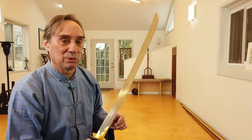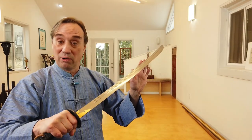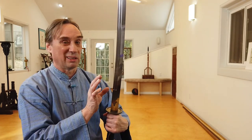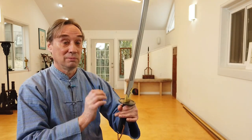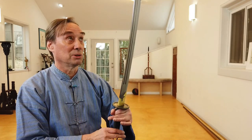So there you have it: three yan mao dao, or yan ling dao — you see yan mao dao more in manuals, but yan ling dao is also a proper name for these — all from the Art of Fire and Iron. Decent forge, good quality blade. Let's see the temper here. This one is a little bit tighter, but I think that's just the edge geometry of the sword, not the heat treating — could just be a little bit thicker, a little different fuller. When I hit it I can feel a vibration in my hand like a tuning fork, which is nice. The other one was a little larger oscillation, but both were exactly as I've seen on antique swords.